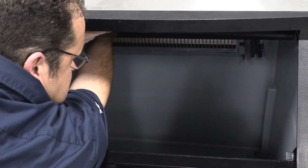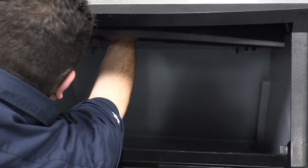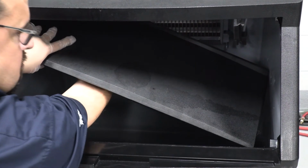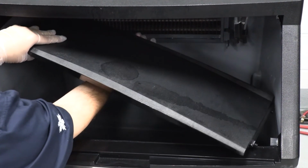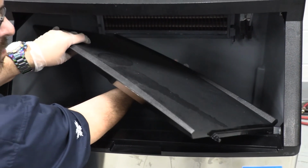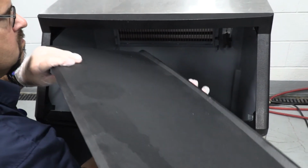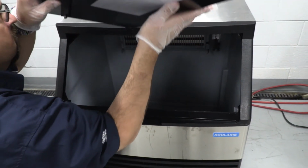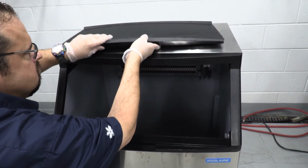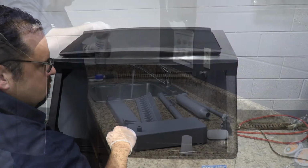Slide the rear door pins off the end and then below the door track. Slide bin door forwards, allowing the back of the door to lower into the bin. Continue forward with the bin door until the front pins bottom out of the track. Lift right side of the door until the front pins clear the track, then remove the door from the bin. Remove all 4 rollers from all door pins.